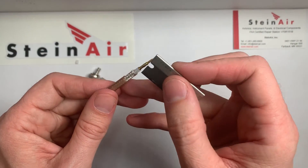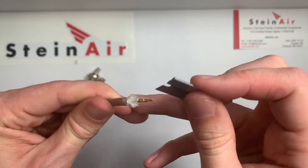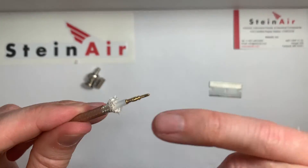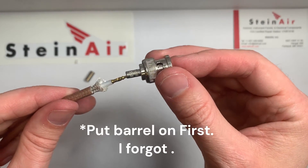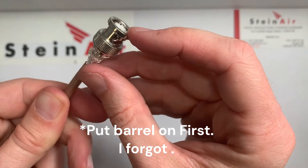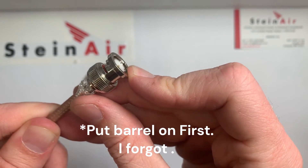Next I'll take my razor blade and just kind of feather out this insulation a little bit — you'll see why in just a moment, I need to open that up. I'm making sure none of that insulation is touching the pin. Then we're going to slide over our BNC contact, and that should snap into place. Hear it click, and the pin should come up almost flush with that white part — it doesn't stick out far, but just make sure it's pushed in all the way.